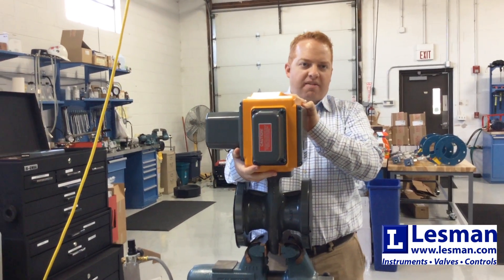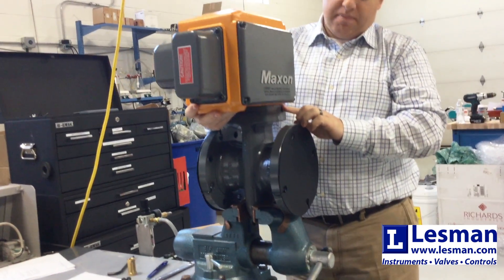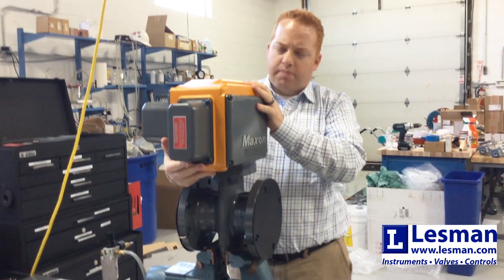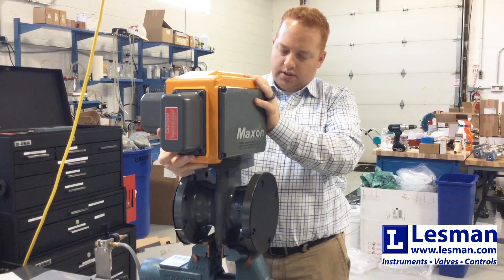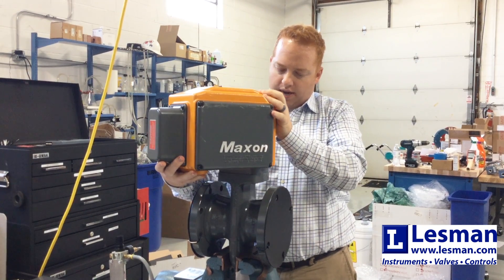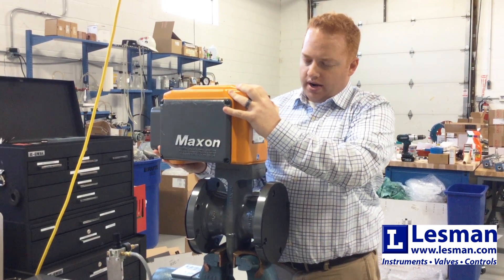It's incredibly important that you continue to hold the valve body on and make sure that the top assembly and the valve body remain in contact with each other — do not lift up too high. If you lift up too high on the top assembly it could disengage some internal components that would not be repairable in the field. So now that we have it loose, keeping the top assembly and the valve body connected, I'm going to slowly turn the top assembly a full 180 degrees.